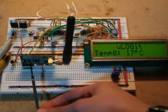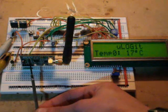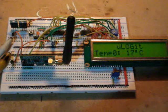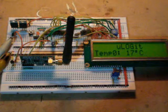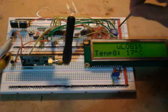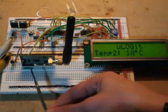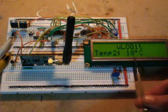We can see a green flashing light just here. This green flashing light tells you that data is being received by this radio unit I have here. Data that gets received gets processed, so I've got a data string which has things like checksums and qualifiers in it. It gets processed, converted into a nice ASCII number and printed to the screen. I can show you which one's been transmitted right now. So that green flashing light is corresponding to this particular section of the display.